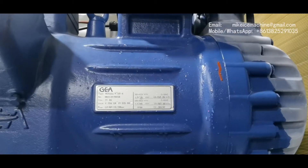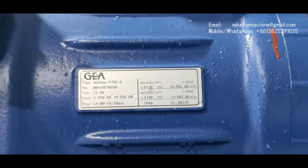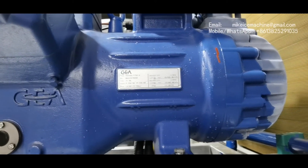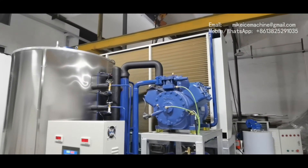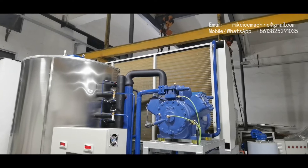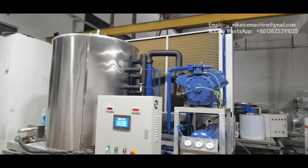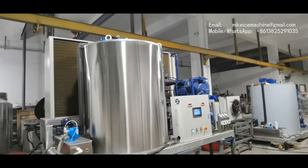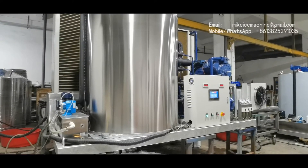This is the 40 horsepower piston compressor. With this 40 horsepower piston compressor, the machine can make 11.8 tons of ice flakes. In Chinese winter working conditions, the ambient temperature is 15 degrees Celsius and the water is around 12 degrees Celsius, giving a capacity of 11.8 tons of ice. In summer, with 30 degrees Celsius ambient and 20 degrees Celsius water, the machine can make more than 10.8 tons of ice flakes.